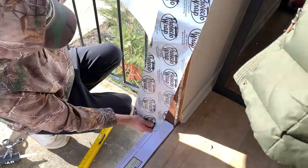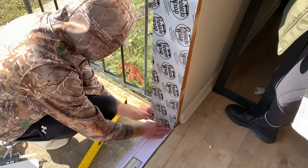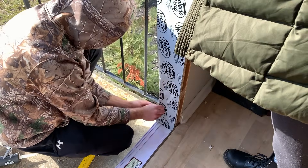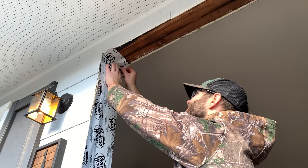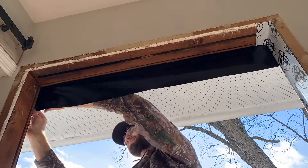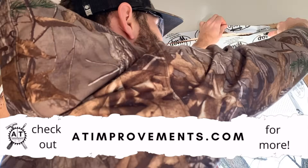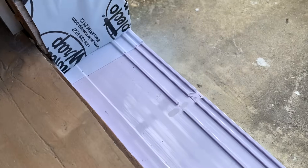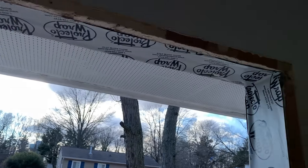After locking the sill plate in place, we're going to install some waterproof flashing along the door rough opening that is going to overlap the sill plate. That way, any water that might get behind the door will make its way down on top of the sill plate and out to the home's exterior, never introducing water damage to your home's frame. I'm running that along the entire side and then over the top, using a utility knife to score it, fold it over cleanly, and trim any excess. Moving to the other side, we're doing the exact same thing — running the waterproof flashing right over that sill plate flange all the way up top, giving us a nice waterproof seal all the way around.